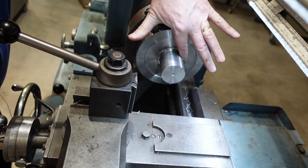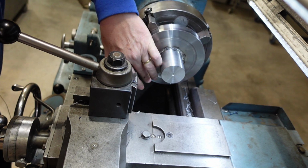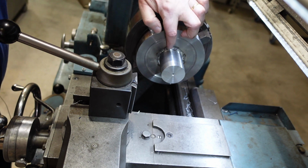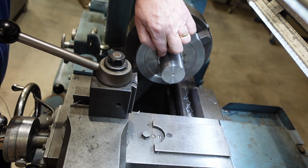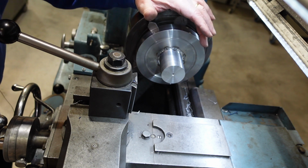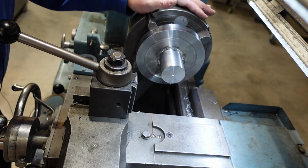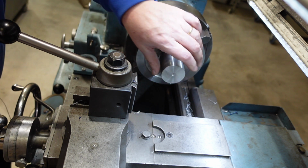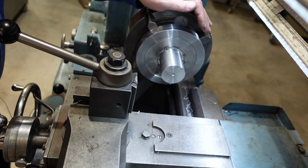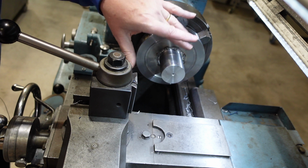As you see, I've got a weld around here, and that's slightly recessed. Now this table runs on this surface, so that's the surface that's going to be in contact with the cast iron. So I've just set a depth stop so that the end of my cut there is 0.5 millimetre, 20 thou, underneath this surface, and that should be fine. On the original there's a groove, but that's because that's one piece, you can do that without any problems. I've put a centre in there because I feel a little bit more secure with the centre, and at least I'll have one now that's concentric with this. So this surface should be concentric with this one, that centre should be concentric with the axis of everything.